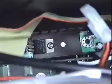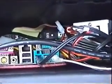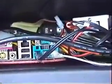As you can see at the back there, now I think I'll focus on there, is the heatsink to the very intelligent power switching device. What that finally lets me do is directly connect in the car's 12 volts DC supply, and also wire in a line for the ignition. So what that little board there does is it detects when the car starts, and then as soon as it's finished cranking, it sends a command to the computer to tell it to start up, which is great because normally if you have your computer wired up to start as soon as the ignition goes on, then I'm sure, as a lot of you have experienced, the computer won't start because there's a drop in voltage and it just isn't enough.